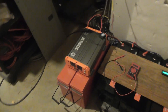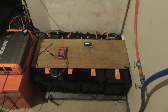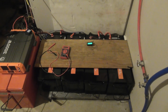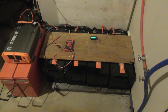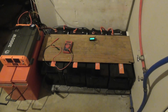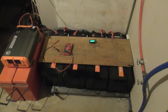I decided to replace the AGM batteries with lithium — these are 200 amp LiFePO4 batteries, and I've got four in place giving me 800 amps... sorry, 200 amps total. I've been running them the last couple of weeks and it's done a really good job — haven't had to run the generator at all. Running the furnace, fridge, coffee pot, microwave — combined with solar input it's been keeping up well. On weekends when I'm using everything heavily, I may need to run the generator if weather isn't good, but overall they've done very well.